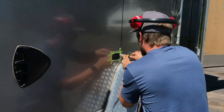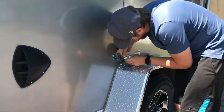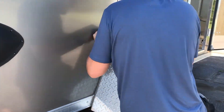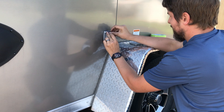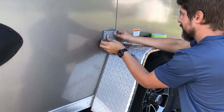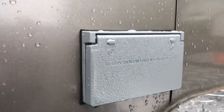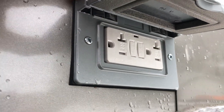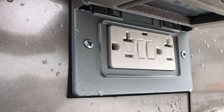I think it's just easier to skip the whole conduit thing — but somebody prove me wrong, let me know if it's worked well for them. So here I am installing a third outlet on the exterior of my trailer. It's a GFCI outlet with a weatherproof cover, on its own dedicated breaker so I can easily turn it on or off. It actually didn't take long before it rained, which gave me a chance to make sure everything was staying dry and sealed up nicely.